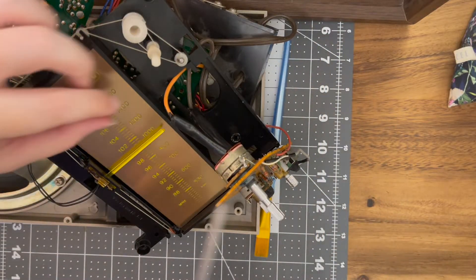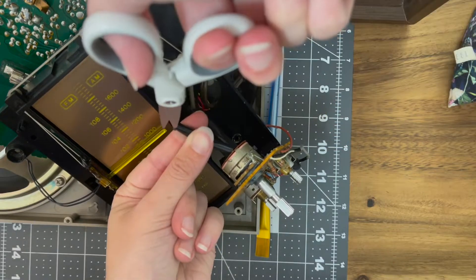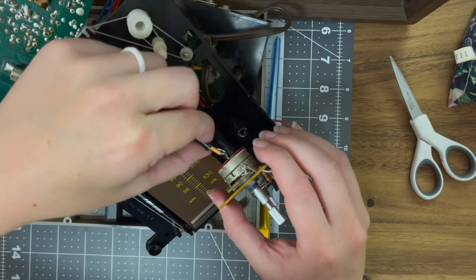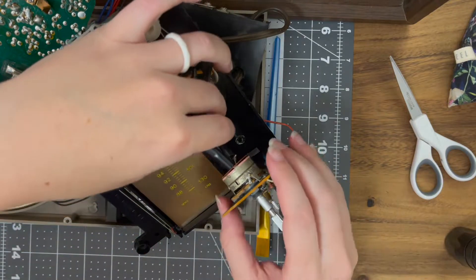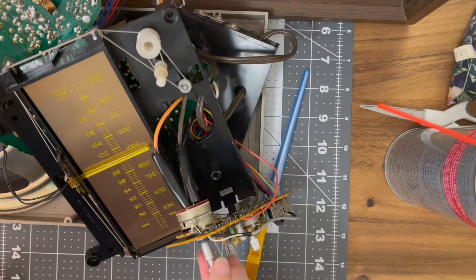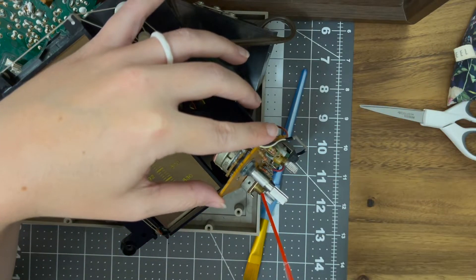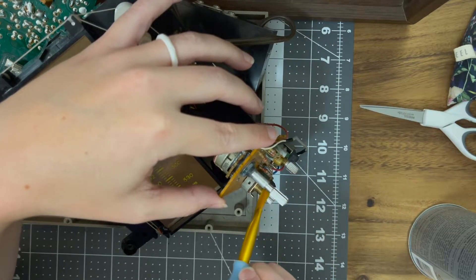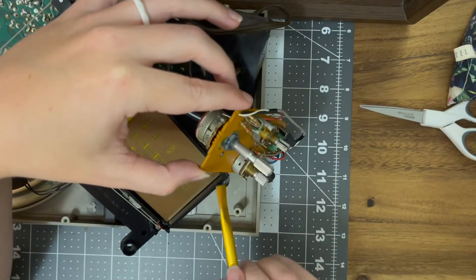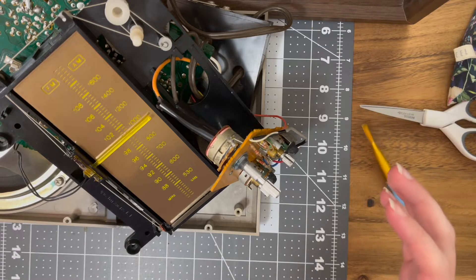I want to see what's going on under here — to be clear, I am not cutting through the wire, I am only cutting through this melted bit, which is really bizarre. I just want to pull that back and make sure everything looks good underneath — and that looks good. What I'm looking for is making sure the connection is still being made and the solder isn't damaged. I might put a little cleaner on these other components too, just giving everything a gentle dusting. Now I'm just going to do all of that in reverse and reassemble it to see if that fixed the problem.